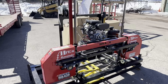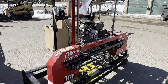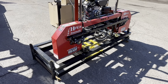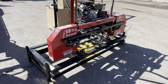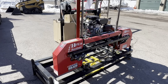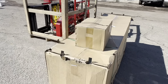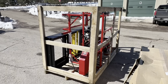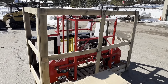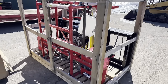The Hudson is 100% assembled — even the lube tank is set up. To get it running, you lift the head off, put the track on the ground, level things up, set the head on, and you're cutting. You could literally have this mill cutting in 30 minutes after dragging it home. In comparison, obviously we've got some work to do with this Woodland. This is the crate we would have around our unit when shipping.